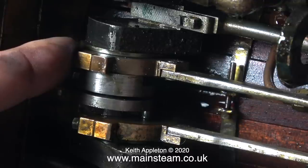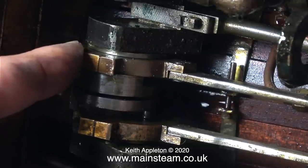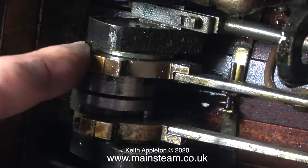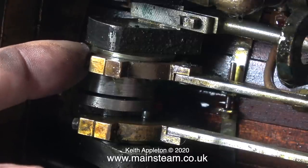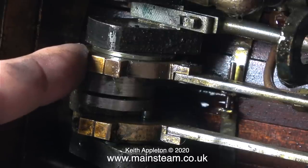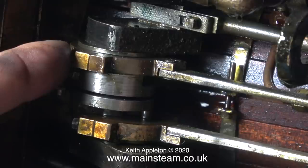The position of each of these quadrants — one for forward and one for reverse — controls the slide valve events in the steam chest to both admit and exhaust the steam. Slip eccentric valve gear is very simple and very easy to make. So why doesn't every other locomotive in the world use it? Well, there's a catch. The first one being that to reverse the engine you have to physically move the engine backwards on the track until the peg in the eccentric sheave engages the other end of the quadrant, then the engine runs in reverse once you open the regulator.